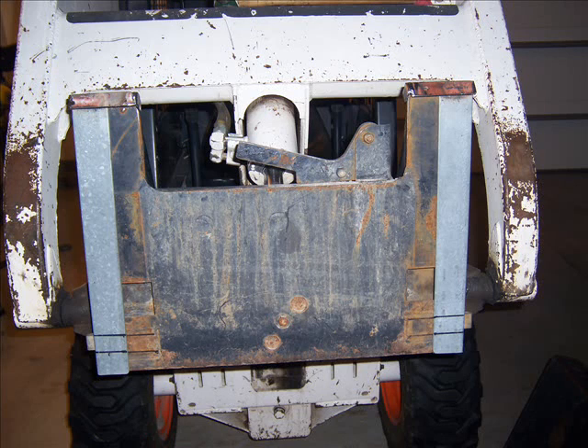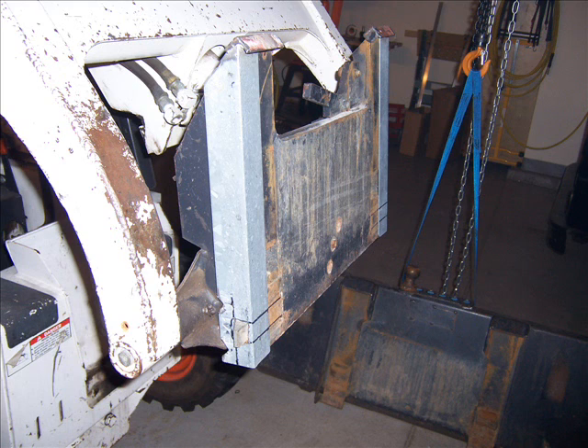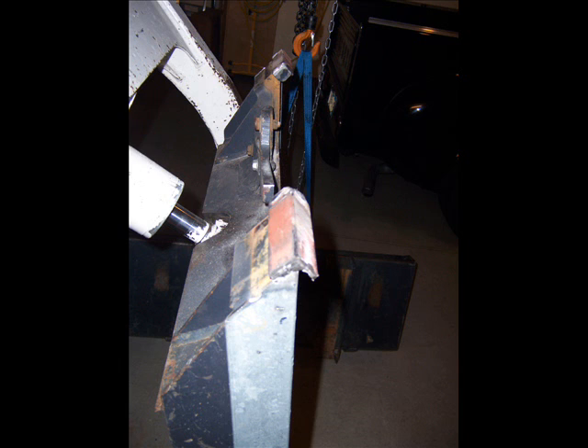Here's both pieces on the tractor as they would fit once the snowplow blade is attached. Here's another view of that same thing to give you a little idea of the detail involved. And here's the piece of angle iron welded to the actual top of the mount. I capped that angle iron so that it wouldn't slip off in either direction.